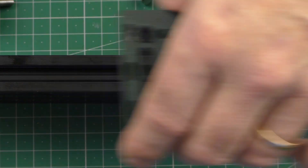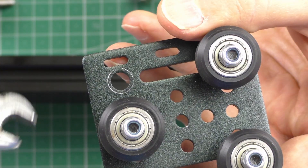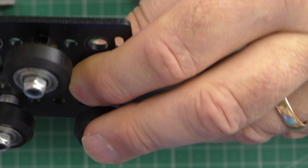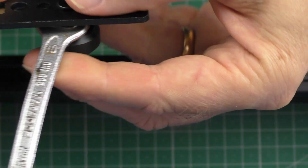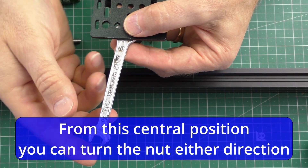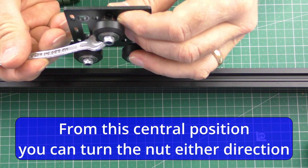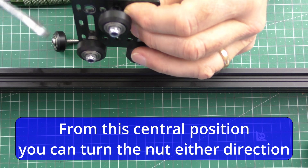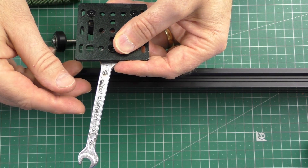What do you need to adjust these? You need a spanner — they normally come with the printer. This is a 10mm spanner. When you're adjusting these nuts, the nut can turn around 180 degrees and that will be its fullest adjustment, but you don't want to do that because then you'll be squashing the wheels together.